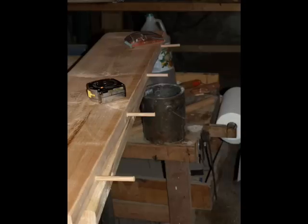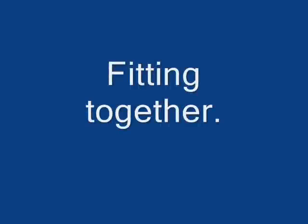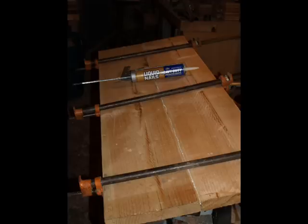There's a change in this because after I did this, I decided that I might have a lot more doweling to do. So I went out to Harbor Freight and bought a dual doweling machine, which works pretty well, and it's quite accurate, and saves a lot of time. You don't have to mess with the dowel centers and all that. You can just drill both holes at the same time. Fitting them together, you just push them in, put in the glue, bang them in.